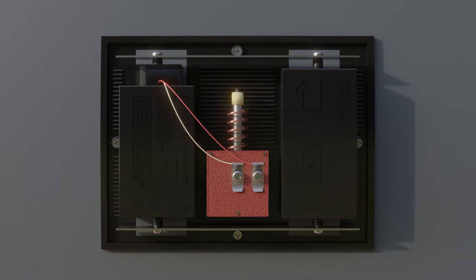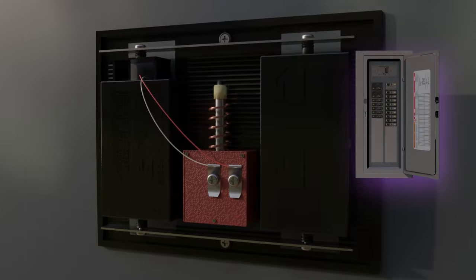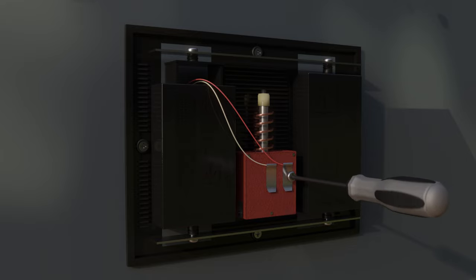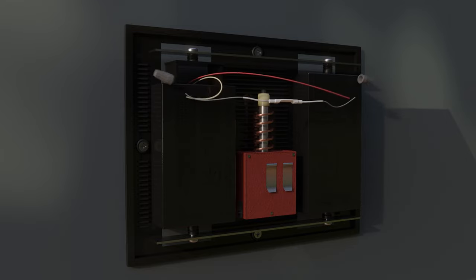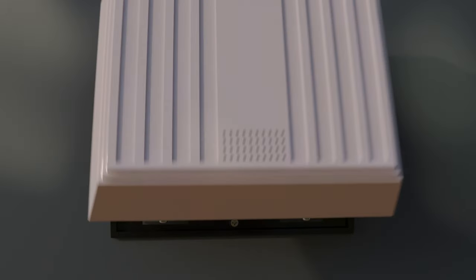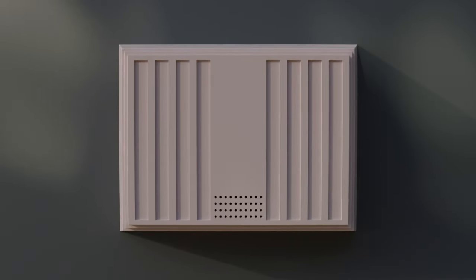Remove the chime box cover and take a photo with your phone of the wiring. Make note of what the wiring looks like in your chime box. If your house has one doorbell, there should be two wires. If your house has two doorbells, there should be three wires. Make sure the power is still off, then use your screwdriver to disconnect the wires. Once disconnected, connect the two wires to each other with the fuse wire, and cover those wires with the wire caps. Attach the chime box covering and you're good to go.